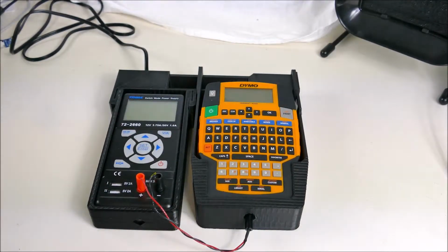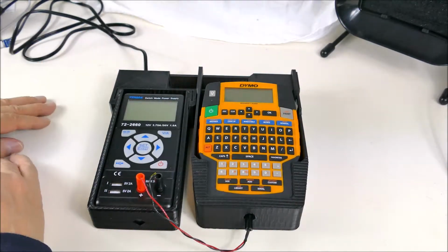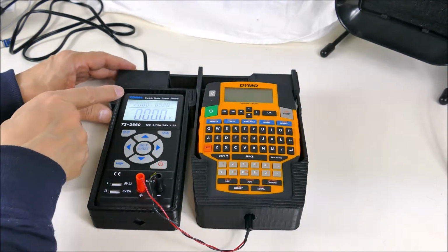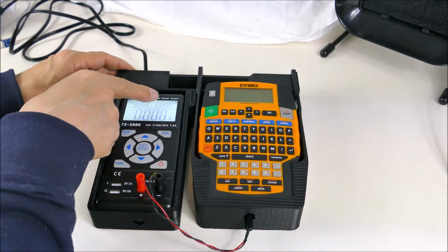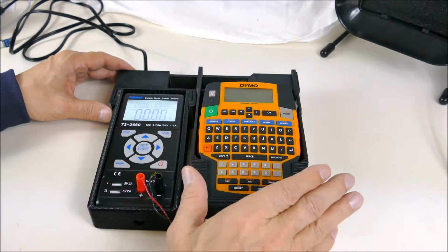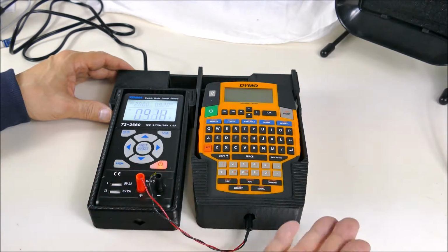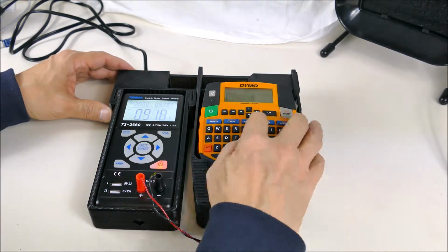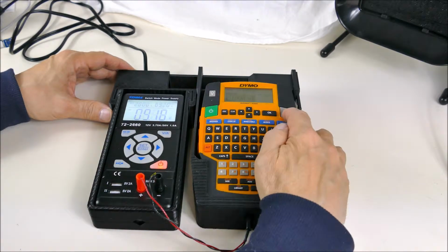Okay, I almost forgot to demonstrate this thing in action. If I turn on the power to this cord, the power supply starts up, and I've got it in a mode where it's 9.2 volts at 2 amps, which is kind of what this thing needs. If I turn on the output, then I turn on the power to the printer, and I've entered in element 14 as some text, and I can print that.